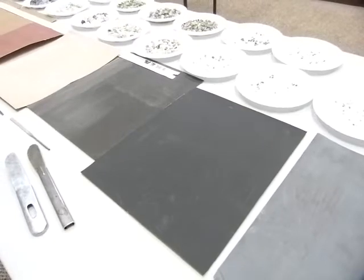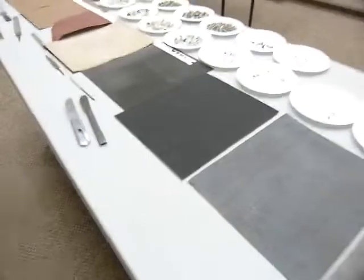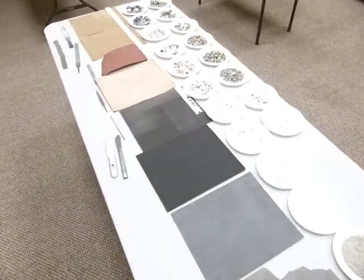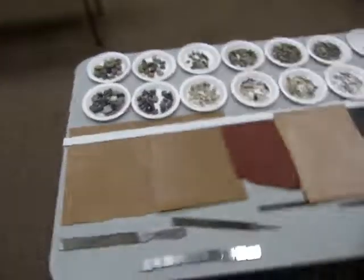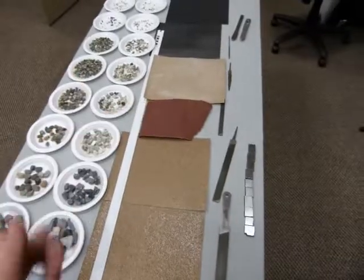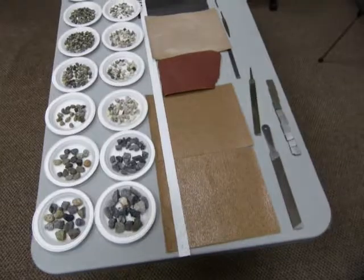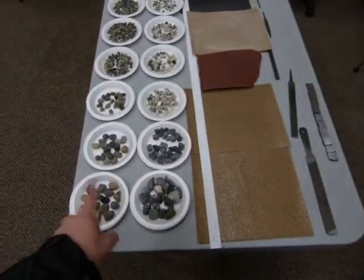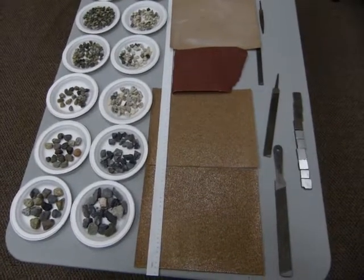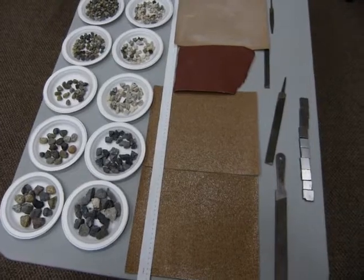That's just going to cost a lot of money for your boss or for yourself. So that's basically how to work smart with sandpapers: consider the grit size, the finished grade, and don't start with your finished grade. Start with a coarse grade and work your way gradually down. Keep in mind how much material is being removed as you work along. And when your sandpaper is worn, just change it.